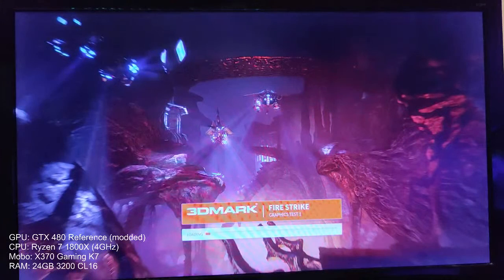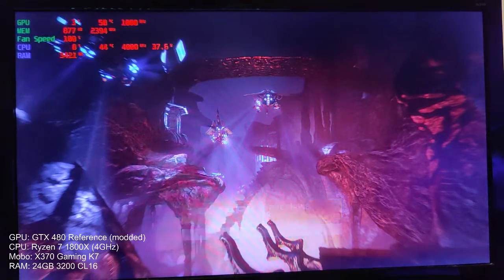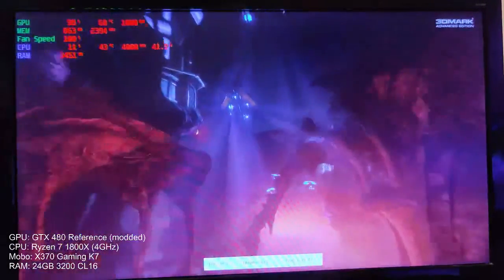It's weird, you say 580s are bad at booting. Mine has no problem. It even is the only one that has no problem of all of my cards. Well, it's weird. It depends on what platform you're on. So my test bench is X370. And it also varies from card to card. Like, the 580 Direct CU2, for example, is really easy to boot. This Lightning and the 2 reference 580s that I have are almost impossible to get to boot.